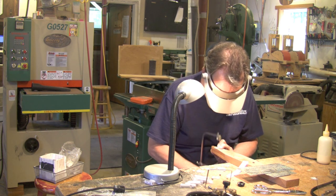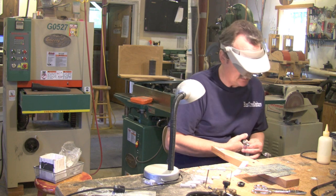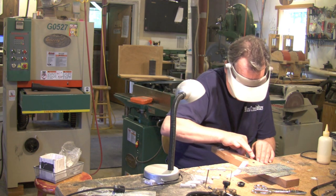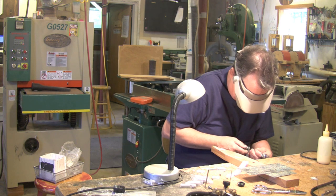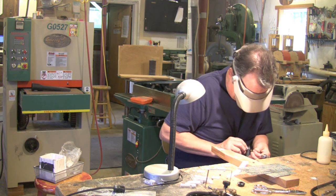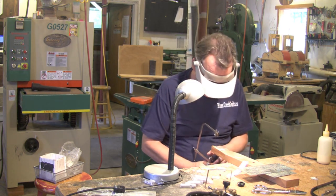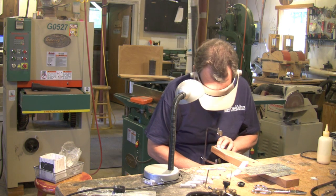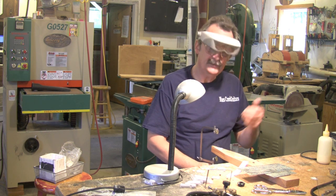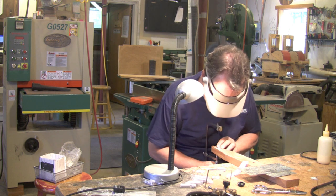You can probably see I'm coming to an inside corner here — and there, a blade broke. Take your blade out. This will happen to you, and sometimes you get some bad blades that are kind of tempered pretty hard. But if you start breaking a lot of blades, it might be that you're getting too tight. When a blade breaks, you start right back at the beginning. If you try to come from another direction and try to match it in, it won't work — they'll leave a little nib there. This way it's a fluid line and you'll always clean up nice.